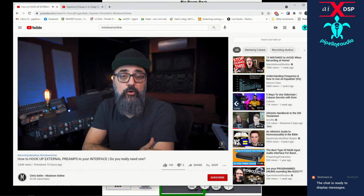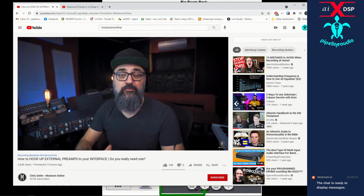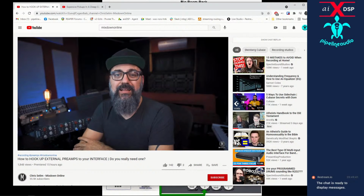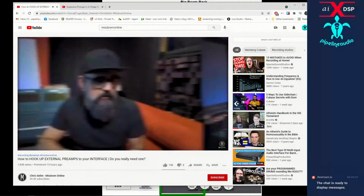And on a lot of preamps, you also have the option of using a 1/4 inch output. So avoid using unbalanced cables to connect external preamps to an audio interface, unless otherwise specified, like it is in my case with the Vintech 473.